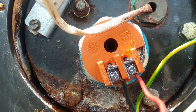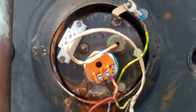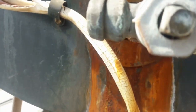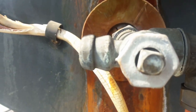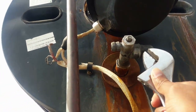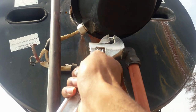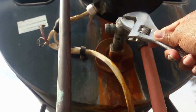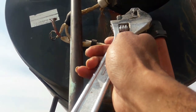To drain the geyser, normally when you move back a little bit from your geyser, at the bottom there's a valve you can open to let the water come out. I think I can reach this standing on the roof. For this I need two hands. All you need is a shifting spanner and you just move it slightly like a tap. Then once you open it, there should be water coming out — open it slowly.